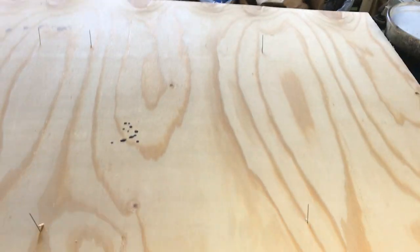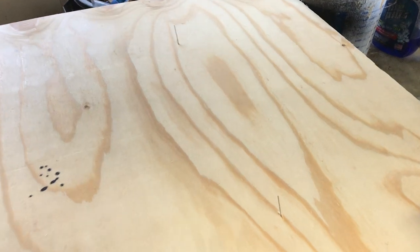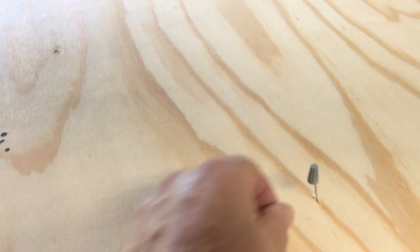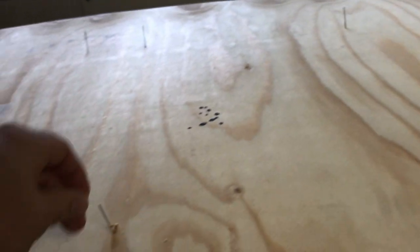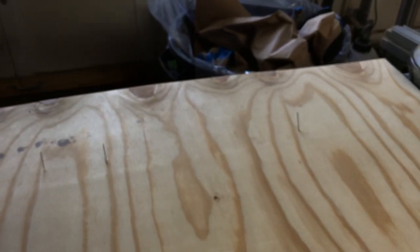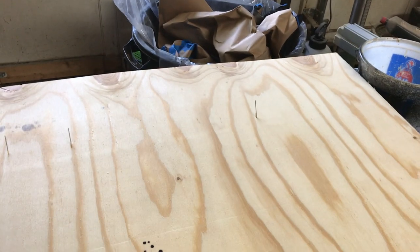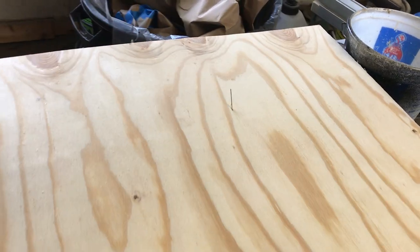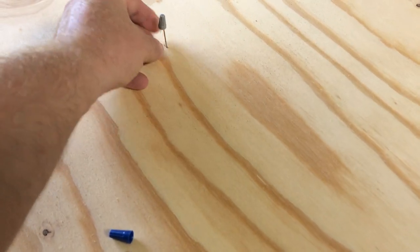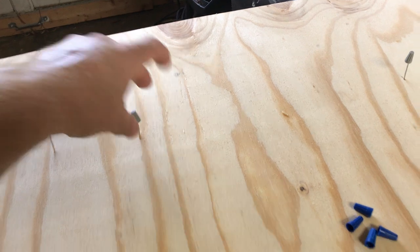You're probably thinking, well, that's going to scratch the paint up. Here is the simple trick: take this wire nut, stick it on top of the finish nail, and you have your standoffs. It's a simple trick to get you where you need to be. You can just straighten your nails up so that they're going in a straight way. I've got two doors, so obviously I've got eight nails.